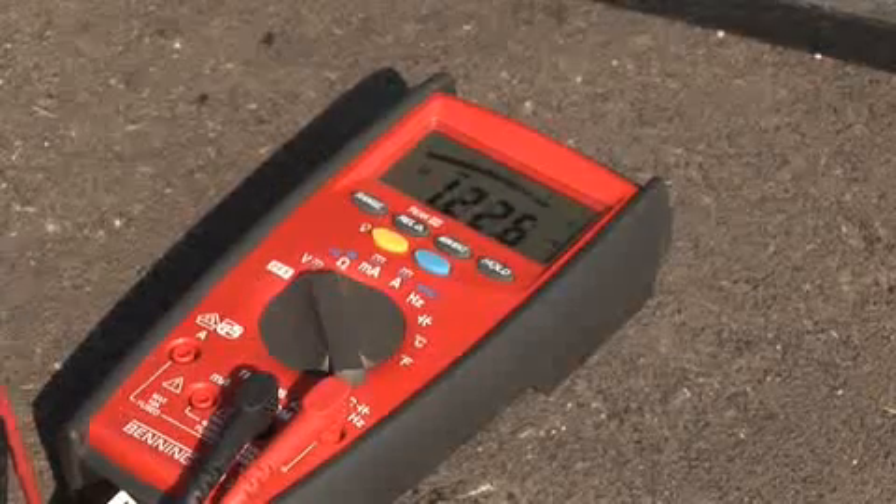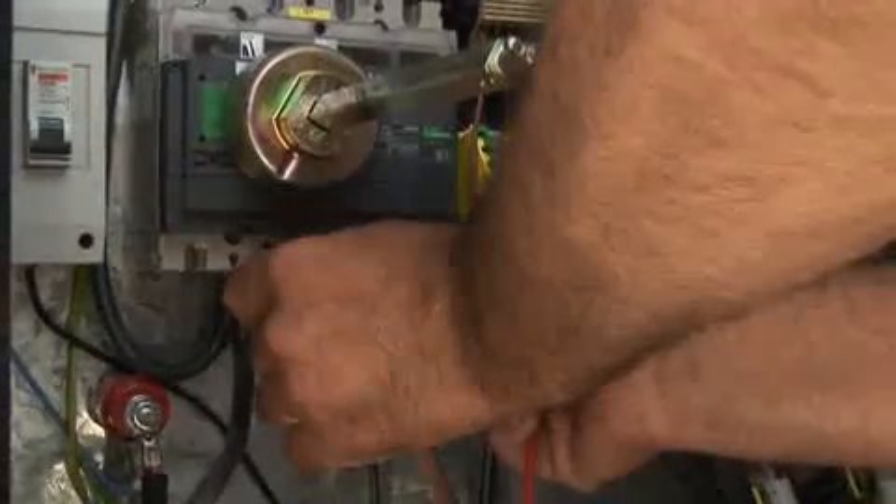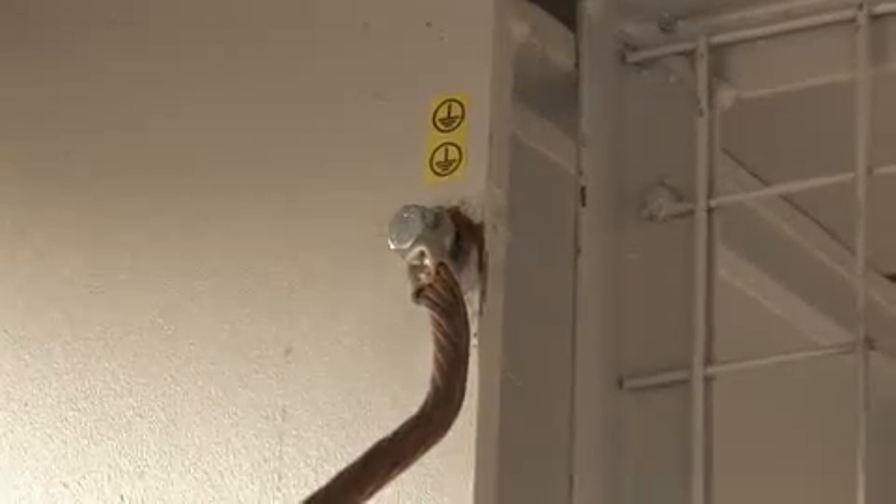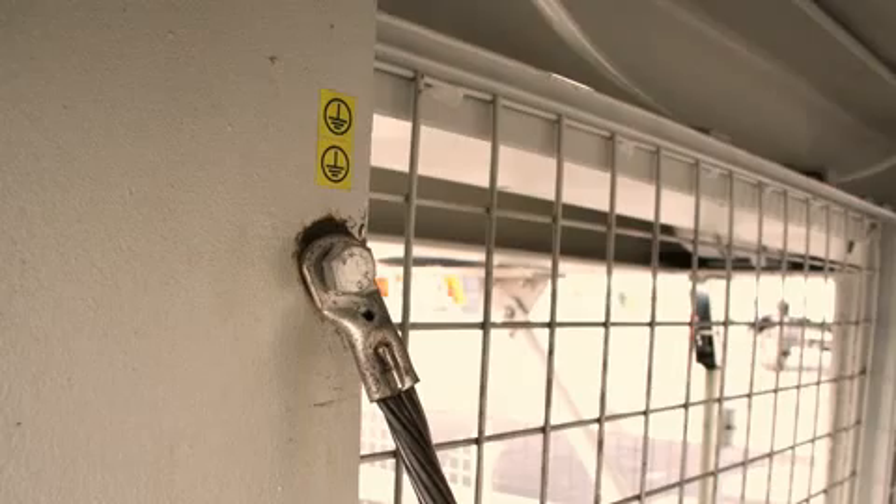Make sure these remain free to operate. Connect power and water supply. It is absolutely essential that the machine be earthed. A total of four points have been designated for connection of the copper earthing conductor.